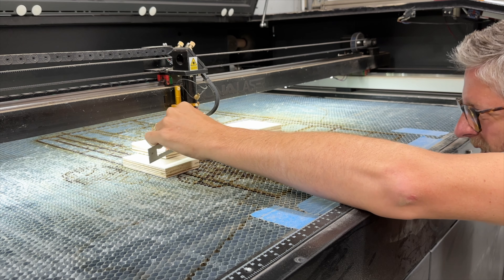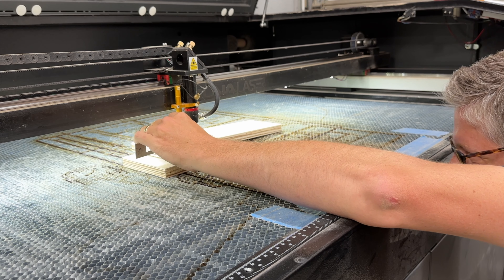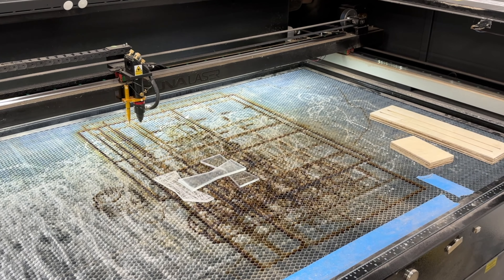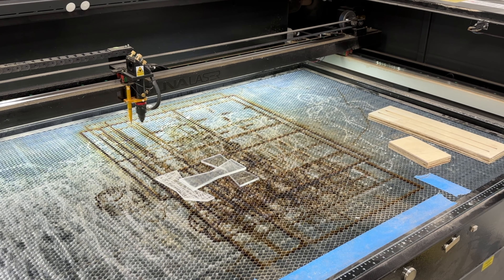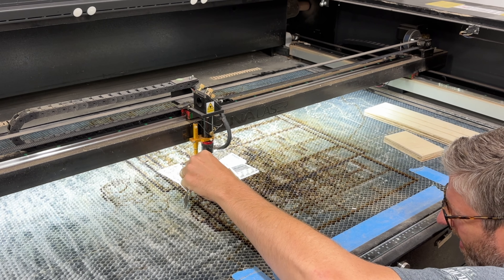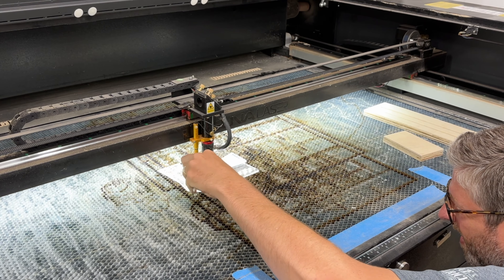What I do — and I'll show you in the next steps — is just create a simple box and cut that out of some acrylic or wood, using your laser to cut out a measuring tool. Then every time you set it, you can just grab that little piece and make sure it fits just barely between the nozzle and your workpiece, and the focal point should be exact. Here I'm cutting a little piece out to use as my measuring tool from some scrap acrylic. If you're wondering why I'm setting these up off of the laser honeycomb, I tend to get a lot of flashback off of the honeycomb that leaves weird marks on the back of acrylic. I've seen others suggest elevating it off the surface, and I seem to get pretty good results doing this.